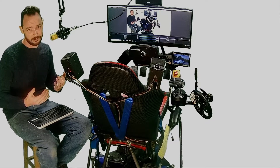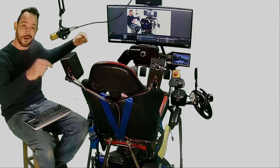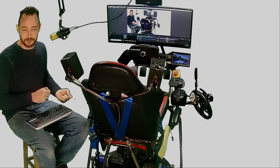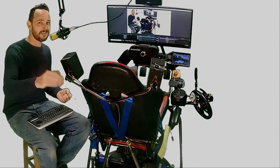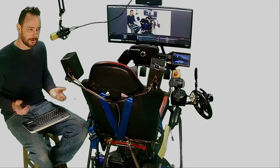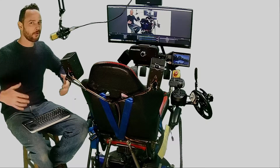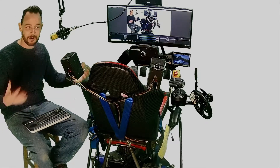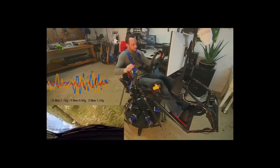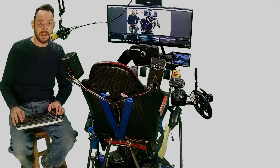Now what's the difference between the two? With the full power kill, generally the motion simulator is going to go straight to the ground, whereas my existing e-stop just instructs the microcontroller to stop moving the arms around. Why would I need that? Well, because of issues — if the microcontroller just goes haywire, one thing leads to another, and pain occurs.